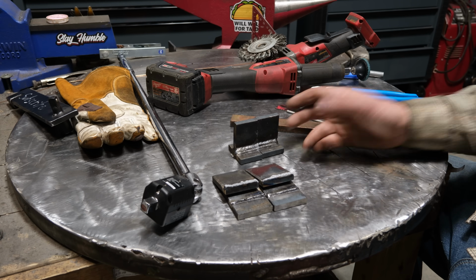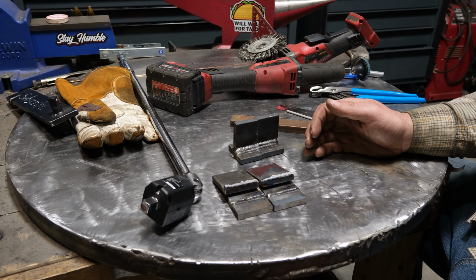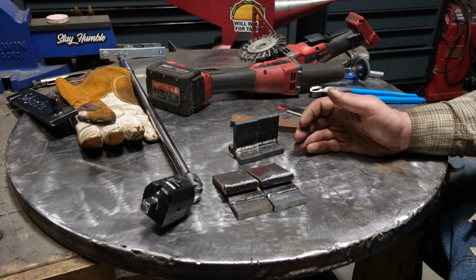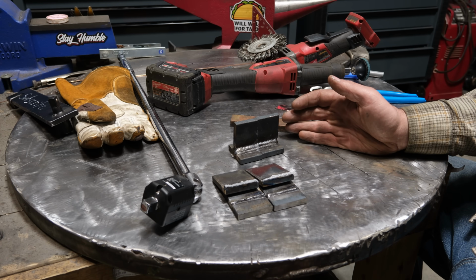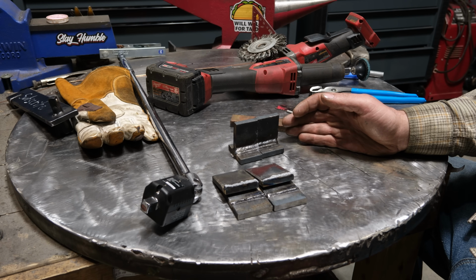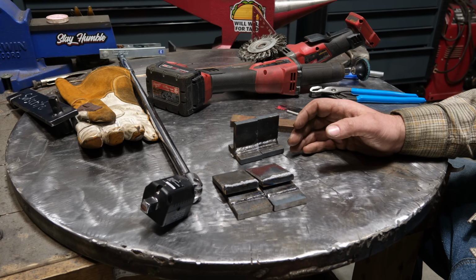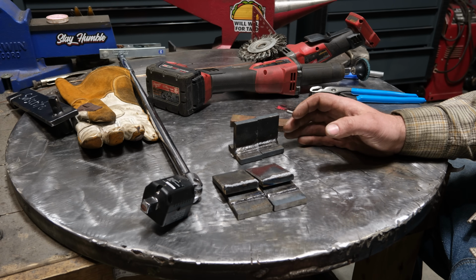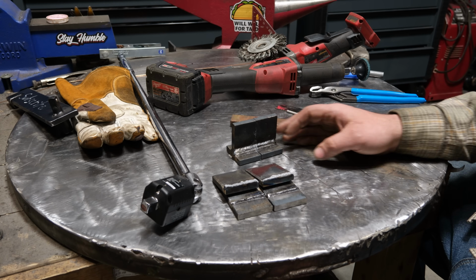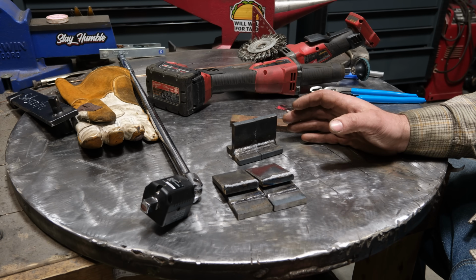But I don't know. I personally, I'll be honest, I tend not to run 6010 much for a root pass anymore, and I do 7018 all the way out on structural stuff, and that's very common in structural welding. You're not going to see a guy coming to a bridge near you running 6010 as a root pass. It's all 7018, 8018, 11018. There's really no benefit in many cases for structural applications of the weaker weld material and the risk of hydrogen embrittlement. But I don't know. It's all food for thought, I guess.